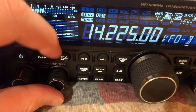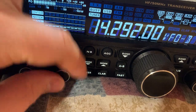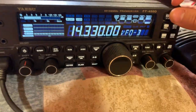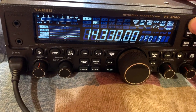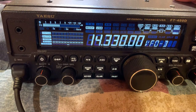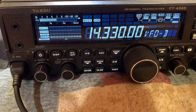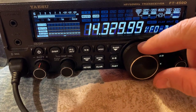Let's try 20 meters. Let's check my SWR without the tuner on — it'll help me see how good my antenna is. Look at that — that's great! I'm using an end-fed half-wave antenna. Perfect SWR. I don't even need the antenna tuner for that band.